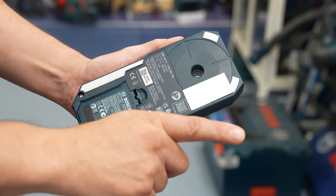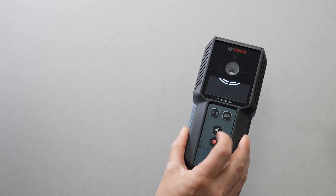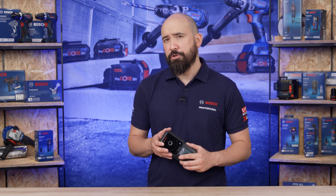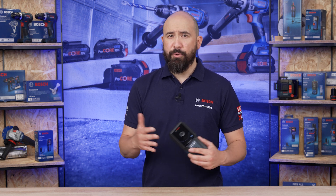There is a warning icon that will appear if the tool has been subjected to a large fluctuation in temperature. Ensure that the sensor area is free from damage and do not place stickers in this area. Turn the tool on before placing it on the wall. As the GMS 120-27 utilises electromagnetic waves, it cannot penetrate foil, metal back panels, or metal foil wallpapers. You will likely receive a false object detection across the entire area, and you will be forced to use alternative methods.